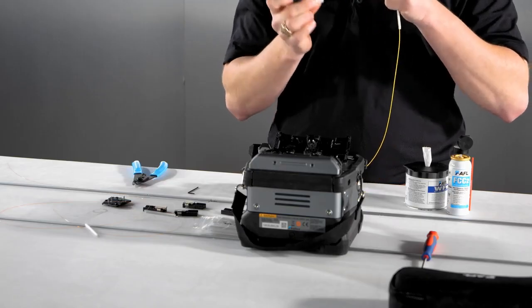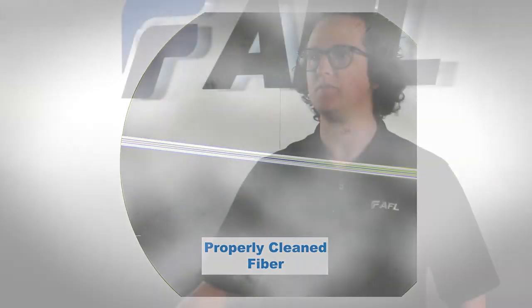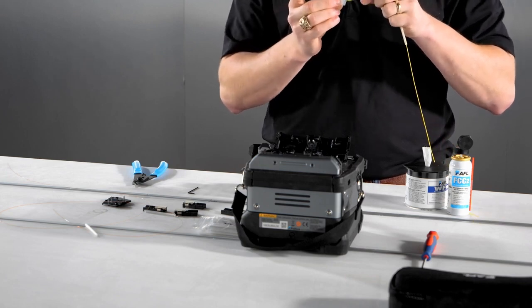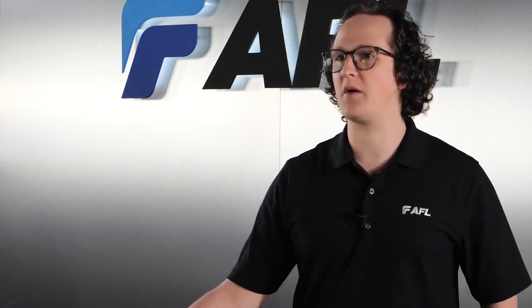After these 2 cleaning passes, the fiber's glass is clean and should not touch any surface other than the clean cleaver pads and blade, and also the splicer's V-grooves. To ensure that you're squeezing the fiber tight enough, listen for the characteristic squeak as the fiber slides through the wipe. This step is crucial to avoid contamination of the fiber cleaver and Fusion Splicer. Clean fiber prep tools and Fusion Splicer will enable repeatable, successful Fusion splicing for hundreds or thousands of splices, depending on how you clean your equipment.